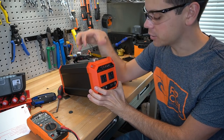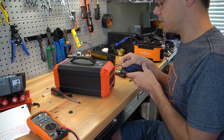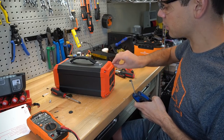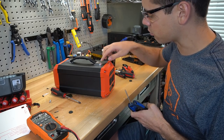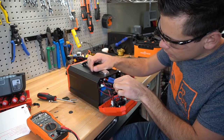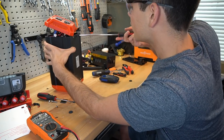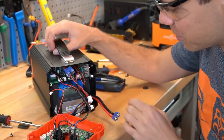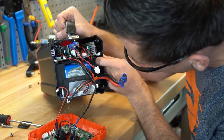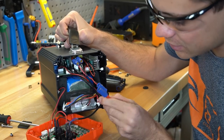This one I'm actually curious about — I don't know what to expect. Some of their models have lithium polymer batteries, and that's what makes them so lightweight. It looks pretty cheap, but it actually has good stats, and I actually used this to power my video studio in my last RV for months. This handle looks really cheap and the metal, you can tell when something's cheap. We need to disconnect the inverter and power cables from the battery. The bottom has safety screws — they're like triangle shapes. Guess what? We have a hobby battery in here — this is a lithium polymer for drones and airplanes. We have a standard balance cable and an EC5 plug.